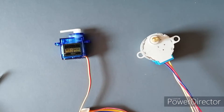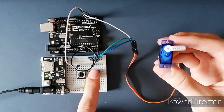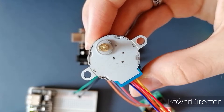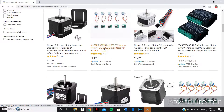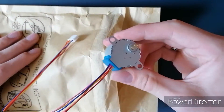Now, I needed to find the best way of turning the sides of the cube as accurately as possible. The best options seem to be either servos or stepper motors, because they both have positional control, but a servo is limited to 180 degree range, whereas a stepper motor can keep rotating for as long as you want. Many of the algorithms to solve a Rubik's Cube require the sides to be turned to more than 180 degrees, so it was best to use a stepper motor. The only problem is they tend to be quite expensive.